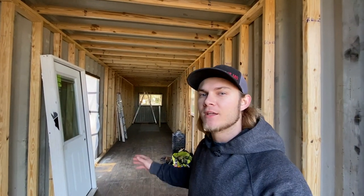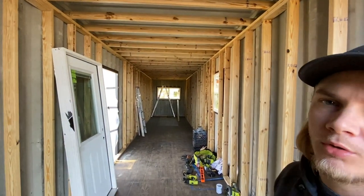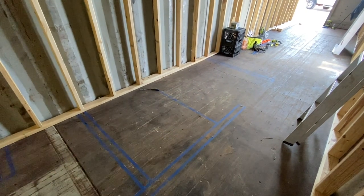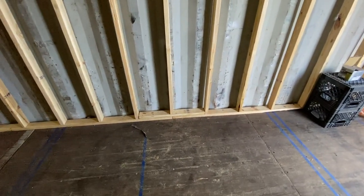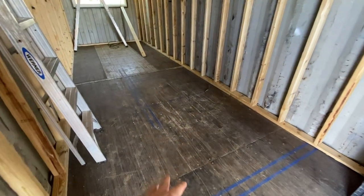Over the past few days I've been able to get both of these side walls framed all the way out, and all of the top boards — rafters, whatever you call them — got all of those put in. Now I'm going to start framing the inner walls for the bathroom and the closet. This is going to be kind of tricky because the bathroom floor is going to be raised in order to have room for the shower p-trap and to make all the plumbing work and come right out that side beam — no pipes hanging below the container when I ship it.